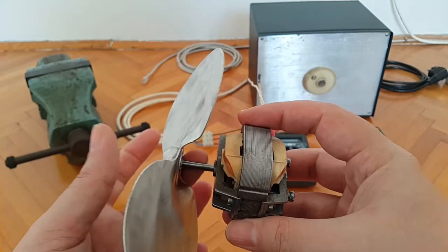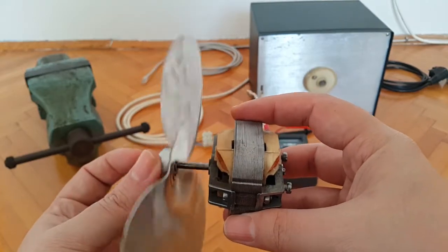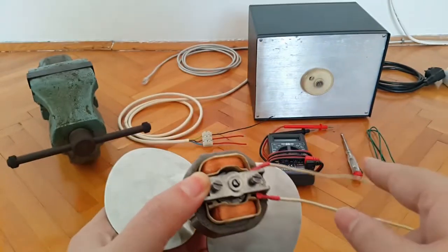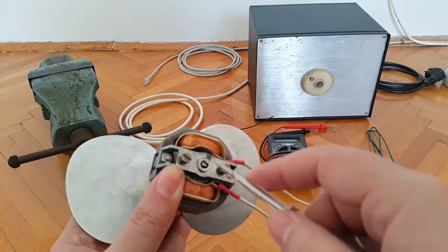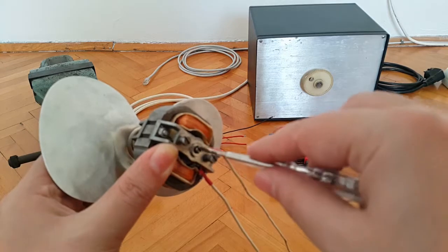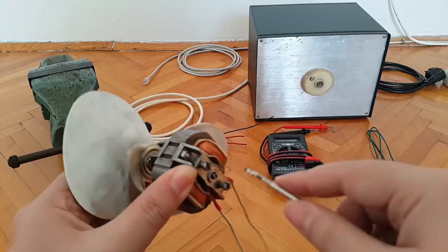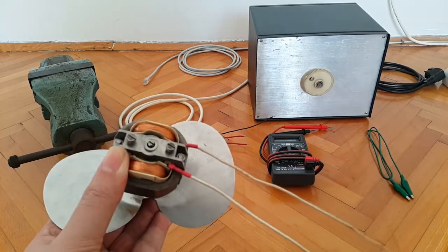And so the shaft is almost 5 millimeters thick, 4.5 millimeters, and you can actually remove this propeller. You can do this of course by using my screwdriver and turning this part here clockwise. Maybe I can show you a little bit. So you put it in here, and you can see the shaft turning. So you remove the propeller by going clockwise, and you secure it again counterclockwise.